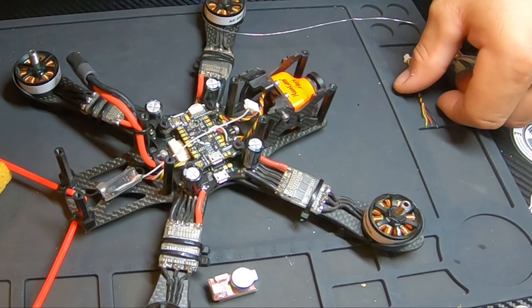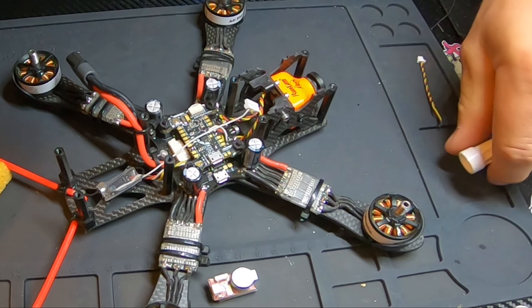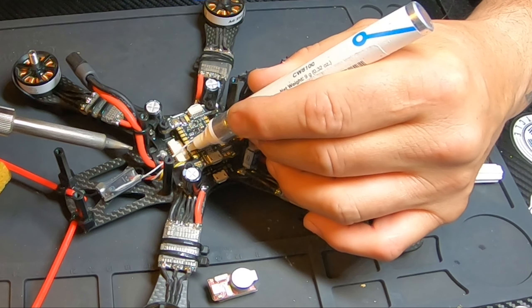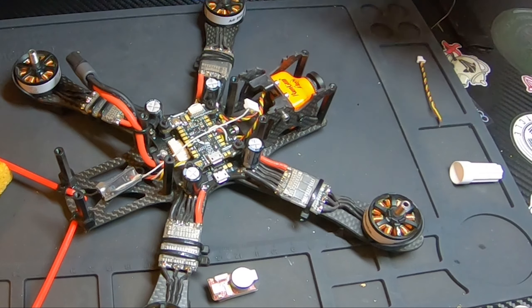As you can see, that got a little dull. That's because we attempted to hit it twice and burnt a little more flux out of it than the other pads. So just tap it with the flux pen and then boom — all better.